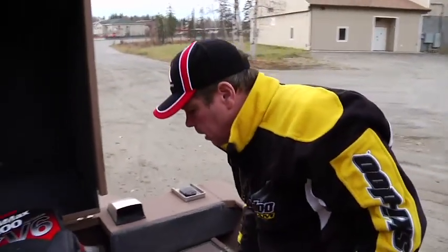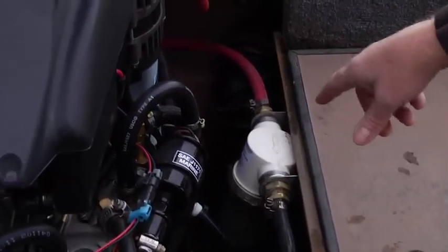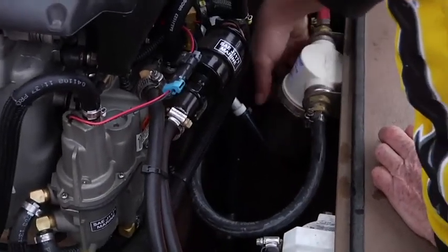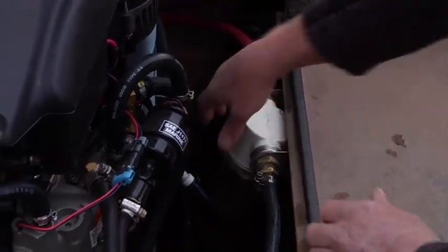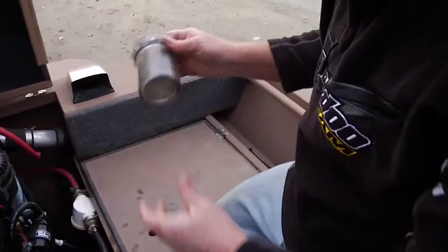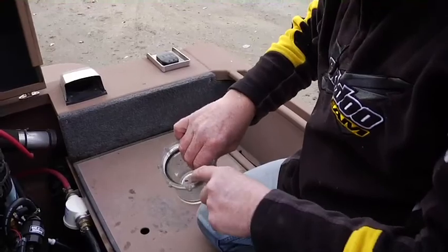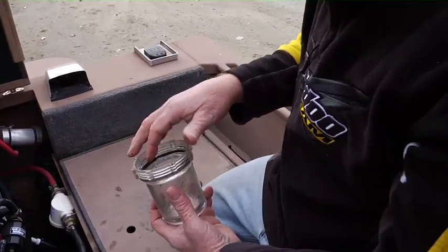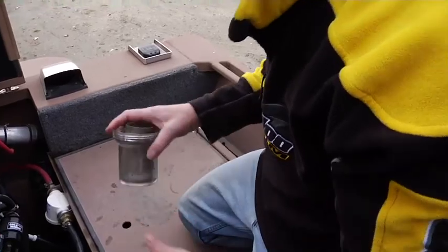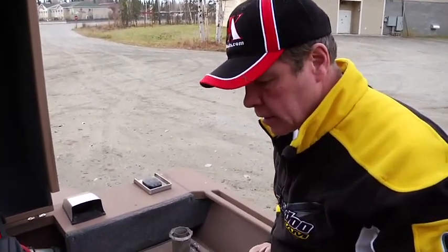This boat has the optional sand trap, which takes your incoming water and filters it through a screen before it goes through the rest of the system. You can unscrew the bowl and dump it out. Important: there is a gasket inside, so if you rinse it in a river keep your fingers over that gasket or remove it first. Carry an extra gasket in your tool kit, because if you lose it, it will spray water inside your bilge area. Drain this at the end of the season.